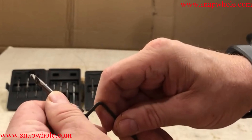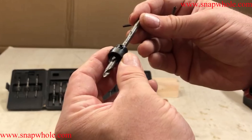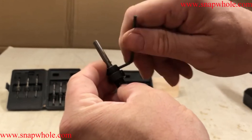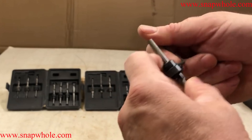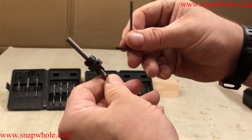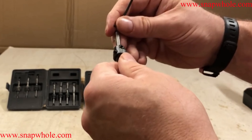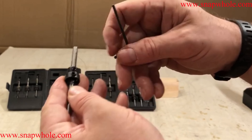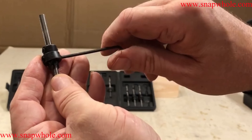First thing you do is loosen these two set screws. You set how far you want to go down into the wood with your pilot hole, then you tighten these — you want to get these very, very tight. I'm glad they have set screws on both sides because that's going to hold it in place better. Now I want to set the depth of the countersink, so I'll loosen the two set screws for the countersink collar. By default it can go all the way back for full depth or further up for less. Set that where you want it and tighten it up.